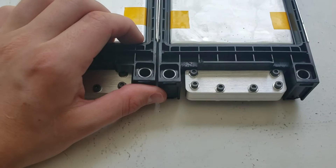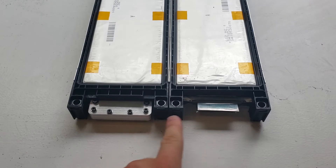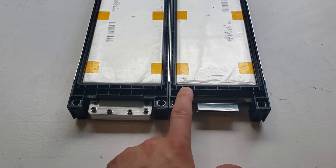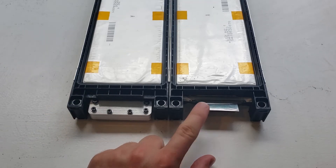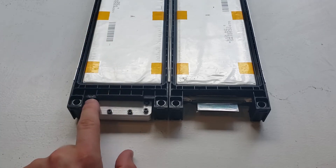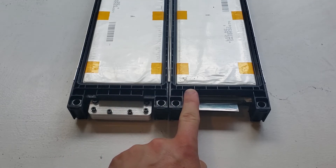So here's the comparison. When you put two modules together in series, that's when the plastic piece of the frame had to be cut even further because I wouldn't have enough space to clamp these tabs on this module up against the cells on the other side. So one side is cut with just the tabs and then the opposite side of this module is cut to this length and I'll show you what I mean.